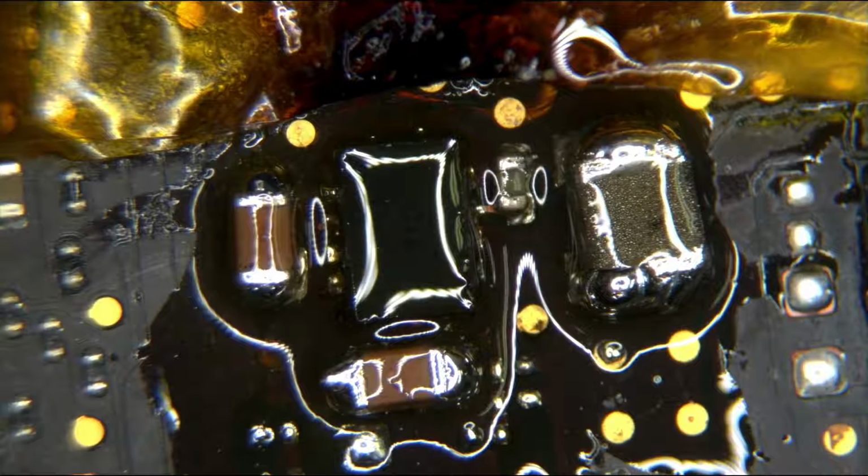So what happened is I soldered everything back on here for PP3V42, and since I was trying to do two things at once, I didn't solder the feedback resistor over here, so this was only creating 1 volt and then going back down to 0, 1 volt, 0, 1 volt, 0, and when I removed the inductor, which is the flat 15, it wasn't working.